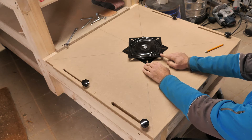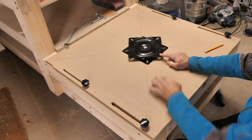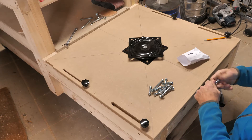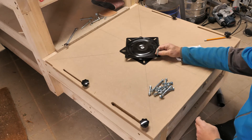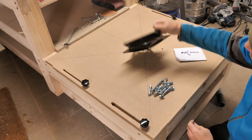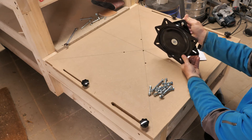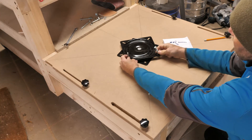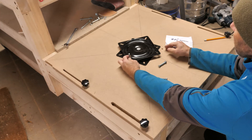But how do you do that when you have these two massive plates? I can swivel it all I like — it won't work, I won't be able to access the screws. So if you want, pause and think about this, and leave me a remark in the comments. What I thought to do is screw this to the top board and fix it, then weld the screw to the captain's chair fitting in the right position on one side. On the other side I can screw it in, and the screws will protrude so I can take the top plate and just get it over them — this part will be fixed, this will be welded onto this. That's the idea.